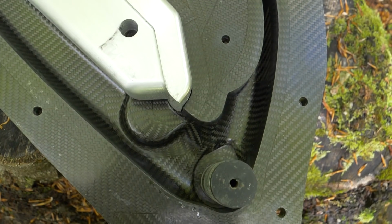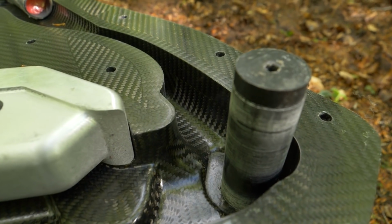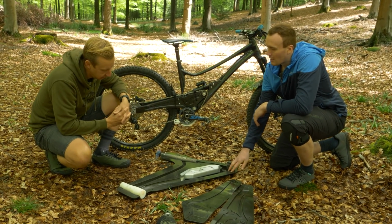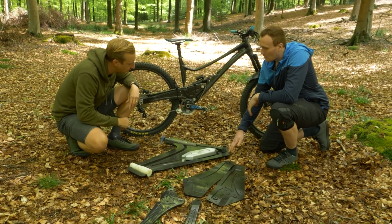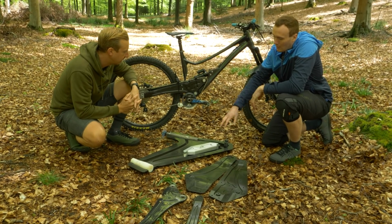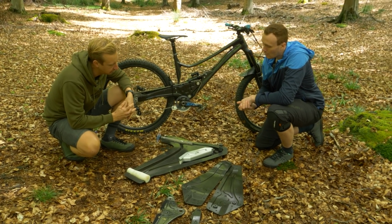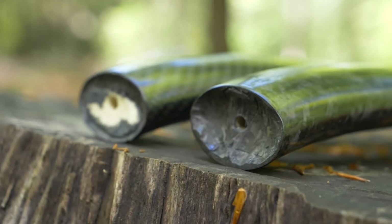But at our company, I guess it's the norm for us. So you tend to get more pulls out of this sort of material than the epoxy board, but then it's less than an aluminium tool, and it can work out cheaper in some methods as well. And then the way I've done this, instead of the internal bagging or bladders like you've seen before, it's essentially an internal foam core that I had inside.